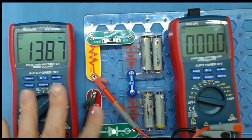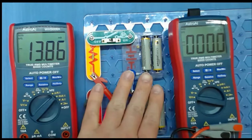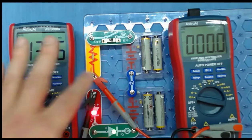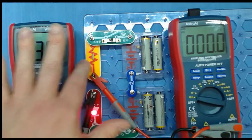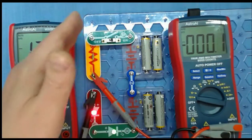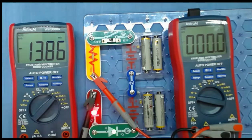to do the math, because if you did the total voltage, that wouldn't work. If we did the 6 volts, we wouldn't have gotten the right number. So we had to use whatever the resistance was. We had to use the voltage that was on that resistance. Now, if there was a way we could do the total resistance of the entire circuit, then we could have used the main voltage to measure that.